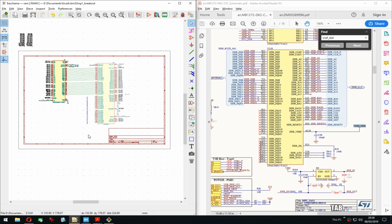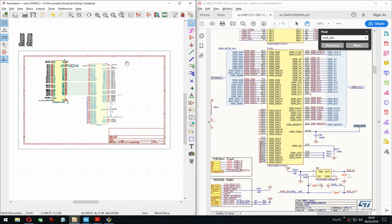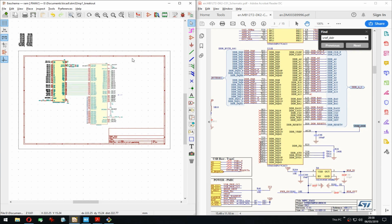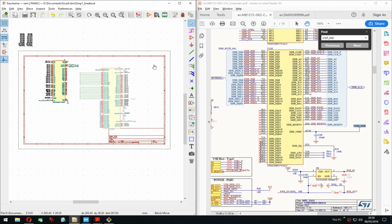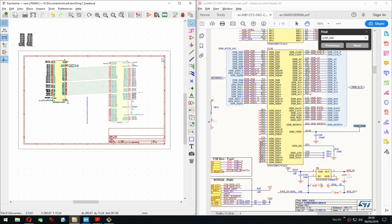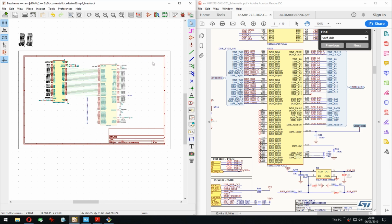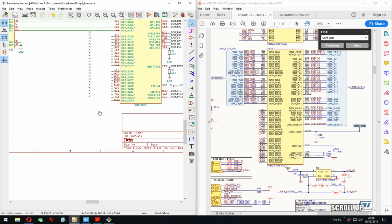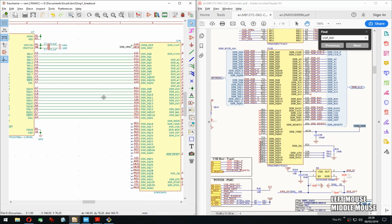Not this. Wait. Oh wow, that's a bug for sure. If I drag with tab, the non-connect symbols are left behind. See, if I select and just drag it, that's cool. Then I press tab, change the mode, and they're left behind. So that's a bug. And that explains why they didn't move last time. I didn't pay attention.